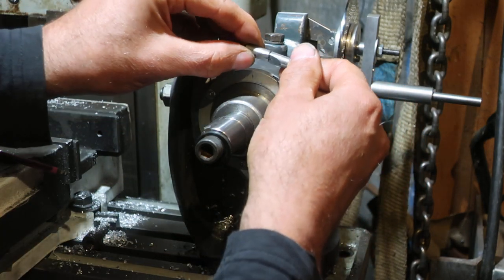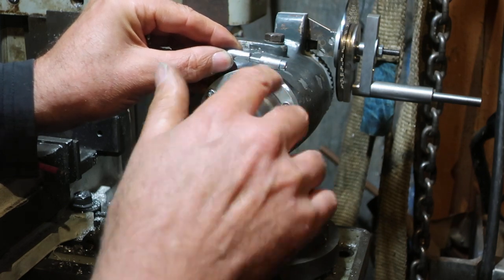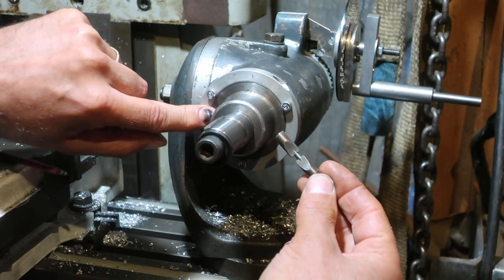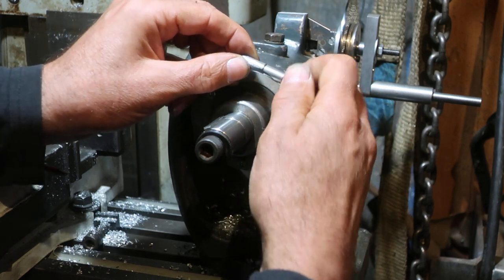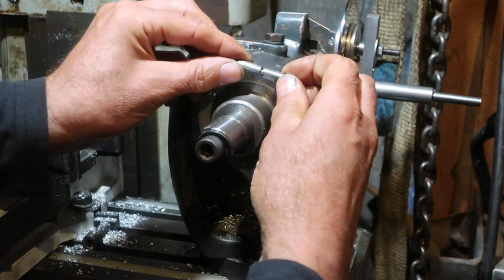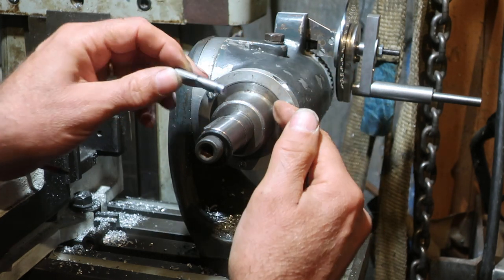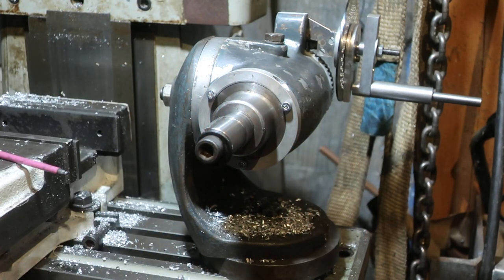Now, because the 4mm bolt is tangent, the 8mm cotters actually impinge on the spindle. And so they were in place in here when I turned the internal diameter, and then separated. So when we tighten this bolt, we pull these two cotters together. So if this is the position where they were turned internally, as we tighten that bolt up, we pull them together and they press on the spindle. And that's how it locks.